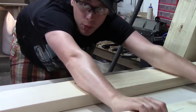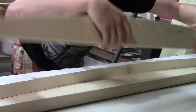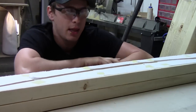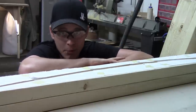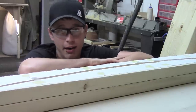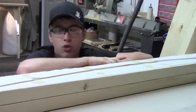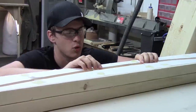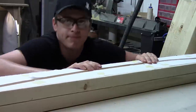What we are going to be doing is taking our boards that we have previously cut out — these are for the center — and putting them on our new boards, using those to trace the heights for all the rest of them. I am not going to give you the exact heights that we use so that you can't copy our exact camber. If you want to have that concave, you do want to make adjustments in the height of each consecutive board so that you will be able to get that concave in there.